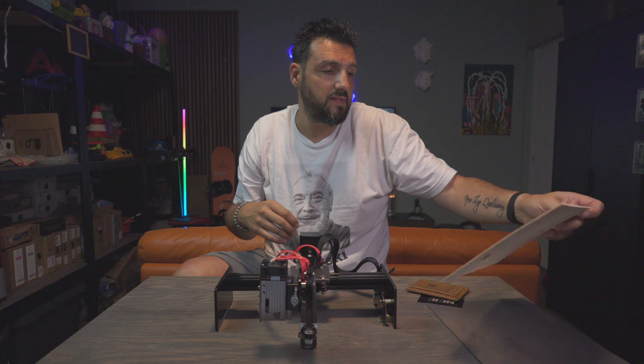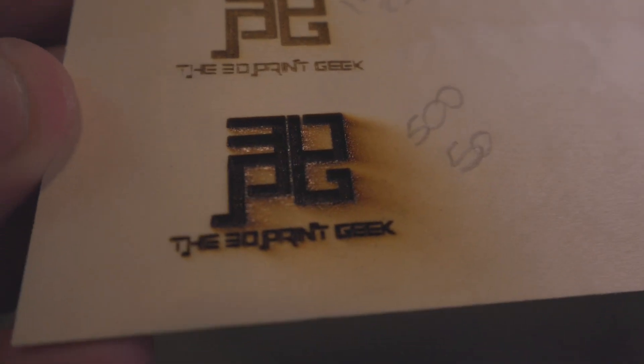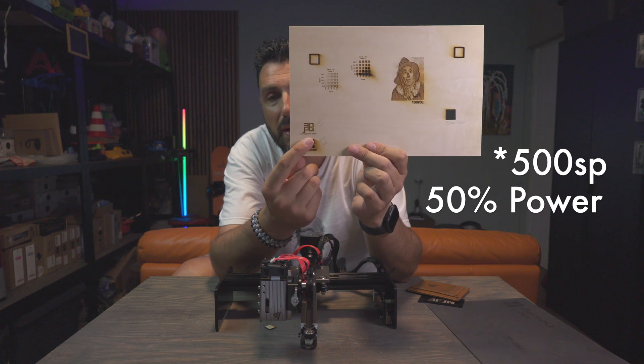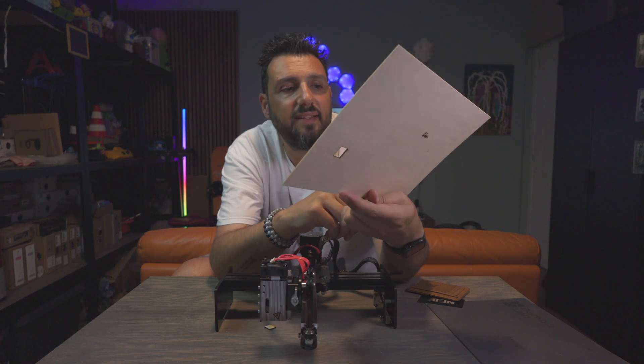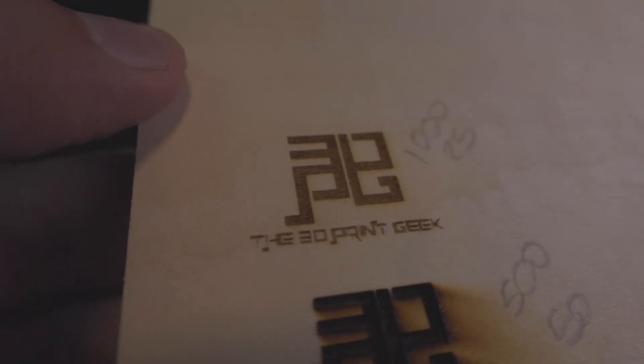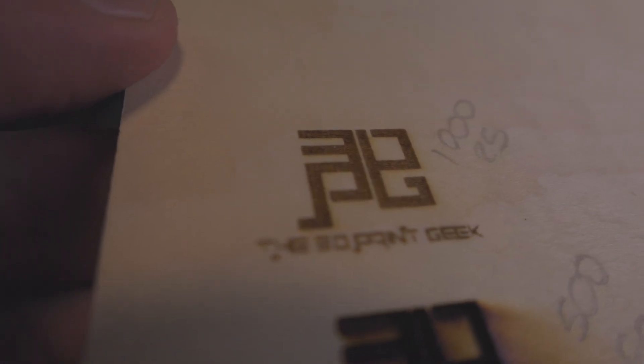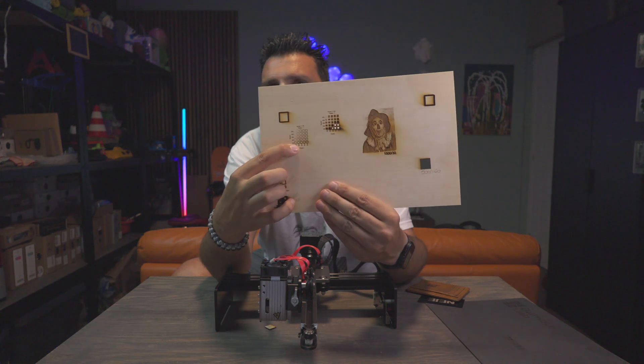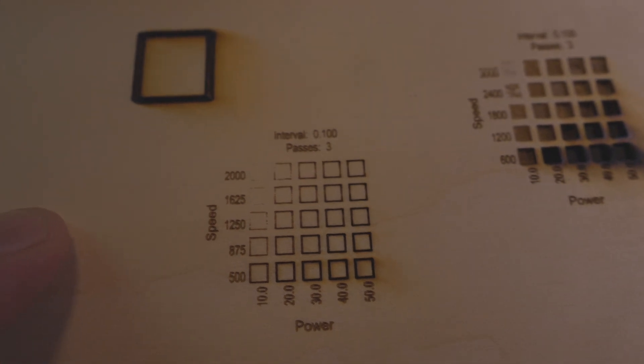The first thing I did was some testing of my logo. First, I dialed in 500 speed at 50% power and what surprised me is that it was too powerful — it was burning the wood. The second setting was 1000 speed at 25% power and this came out amazingly. I loved the way it went through the plywood, probably half a millimeter deep. Then I did two more tests, and as you can see from the closeup, they were pretty impressive in speed and power dosing on 3-millimeter plywood.